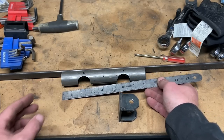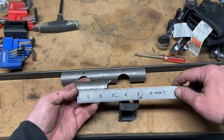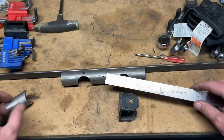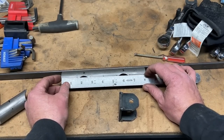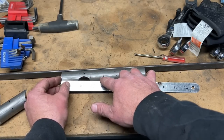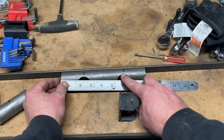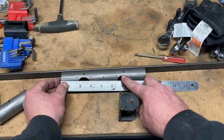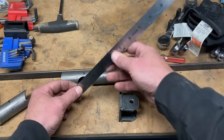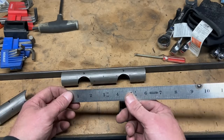And then I took my template of the cross member I had in there that I cut, and it's exactly 2¼ inches. So that kind of turned out easily as well. So I marked 4 inches as the center line, and then I marked 1¼ inches to each side, drew a boundary, and then 5/8 of that because it's 1¼ inch hole saw, and then another 5/8 onto that to show my end boundary. That gives me my holes. I offset it down 5/8 of an inch, which is 1/2 of an 1¼ inches.